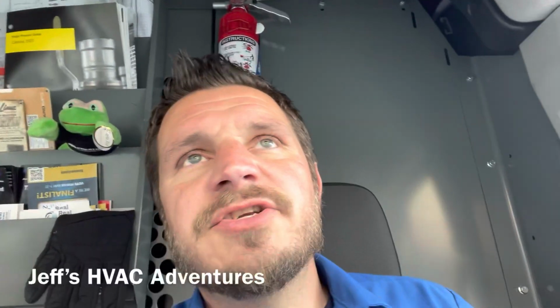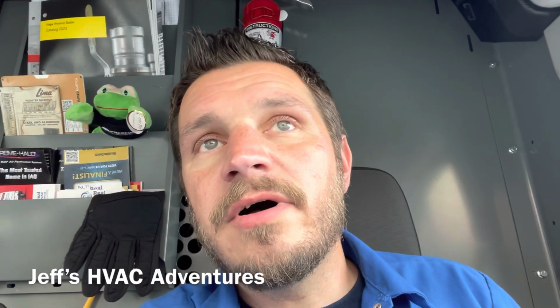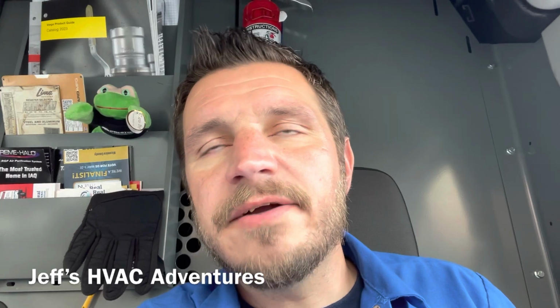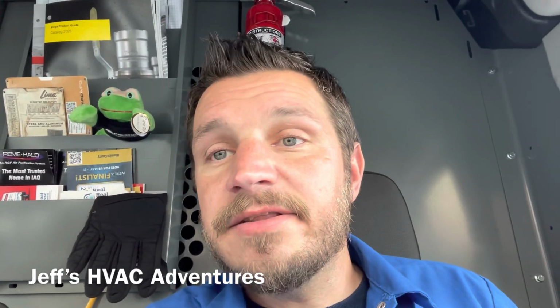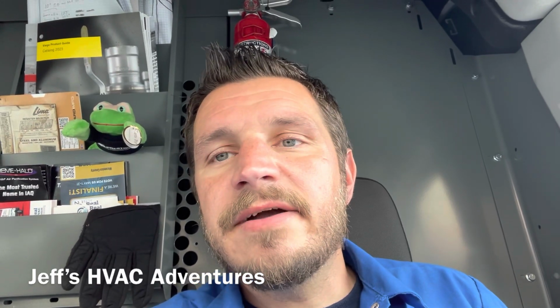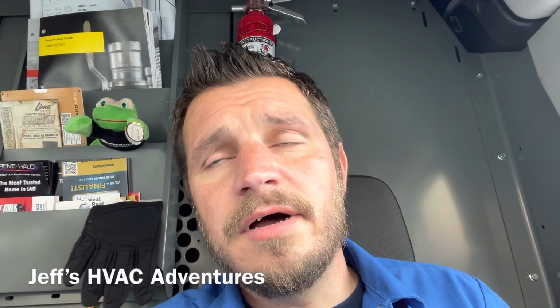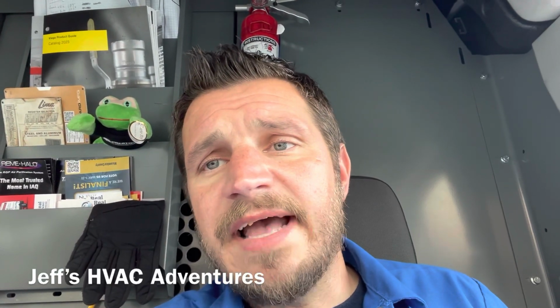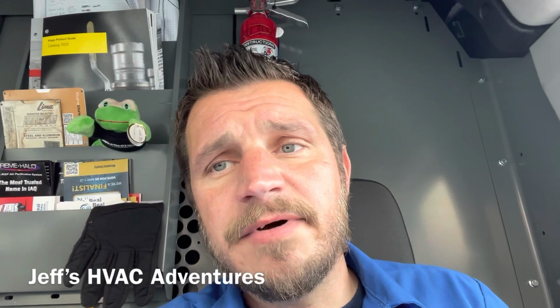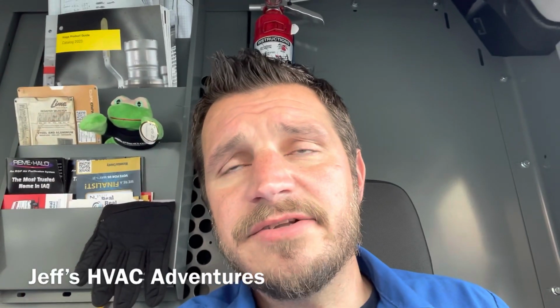I just finished a call where I had to replace the thermopile on a gas fryer. It didn't fix it though, the gas valve's bad. So the customer is on the fence about getting a new gas valve, which is very expensive for a millivolt style gas valve. They're like $350 cost. So it would cost him even more than that for me to sell it to him.